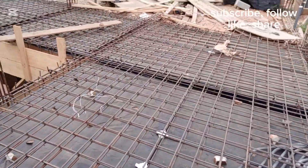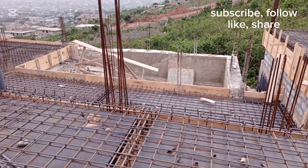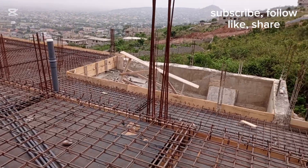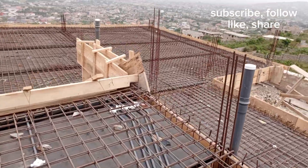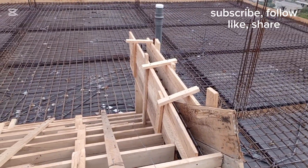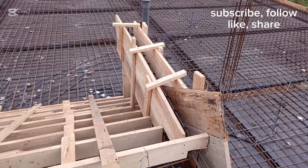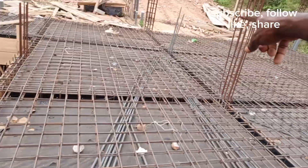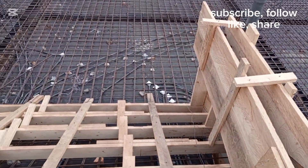There is a pool here, so I'm going to give it a sub-panel — or sub panel circuits — for the pool pump and other electrical items. There are five pieces of PVC pipe: if it's a three-phase system, we'll have Phase 1, 2, 3, Neutral, and Earth covered by those pipes. These pipes run from the distribution board or consumer unit all the way to the pool area.